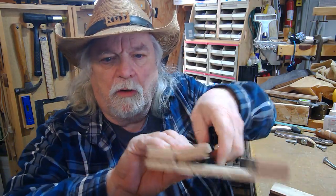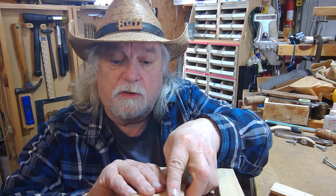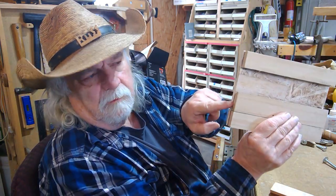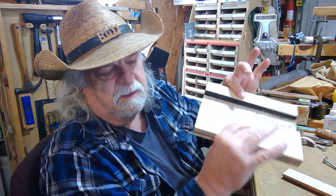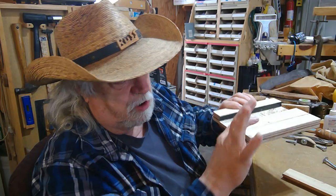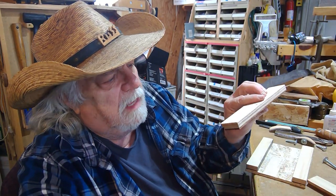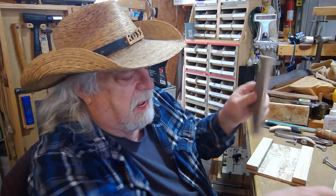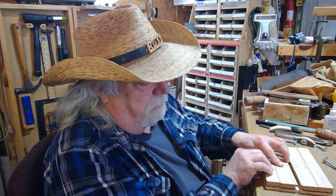When you glue this up, you're gluing this surface and this surface, so this thing is actually being glued on two different planes — that makes the glue-up very strong. If you want to add extra strength, just shoot some brad nails or screws to hold it as well. You can use three-quarter-inch screws since this is now three-quarters of an inch thick. I'm using half-inch plywood here — actually flooring cutoffs — but use good quality plywood. Half inch is a good dimension to use on a three-quarter-inch piece of material.